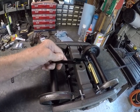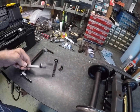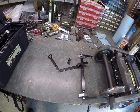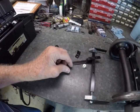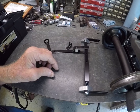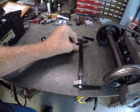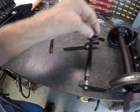What I did was make a step-down, so this step goes in like this all the way to the bottom, giving you your clearance. It runs like this. There's a little wheel here — it's a shim I get at Lowe's, just one of those nylon bushing things. You just put a 10-24 button head screw through it, and that rides against the shoe bar hanger holder. As it moves back and forth, it makes it a lot freer, as you can see right here.